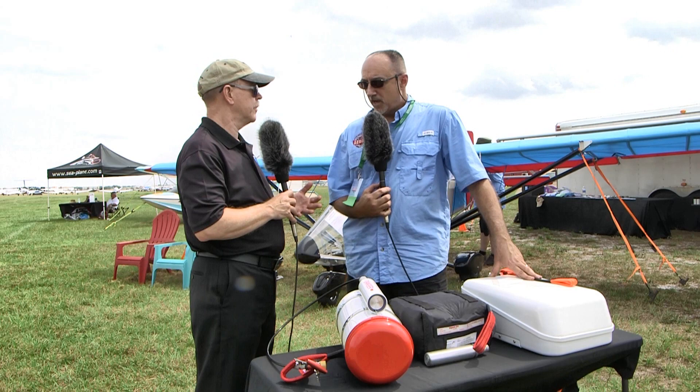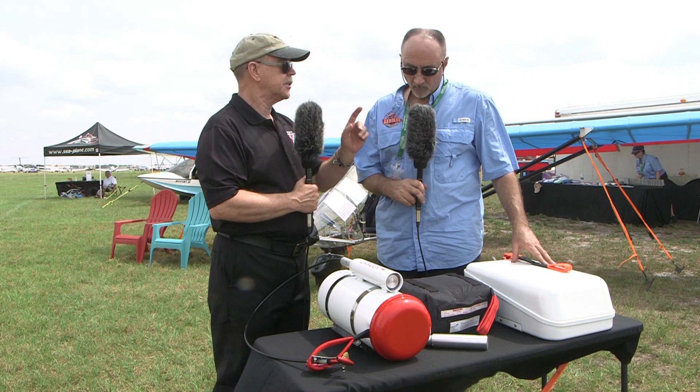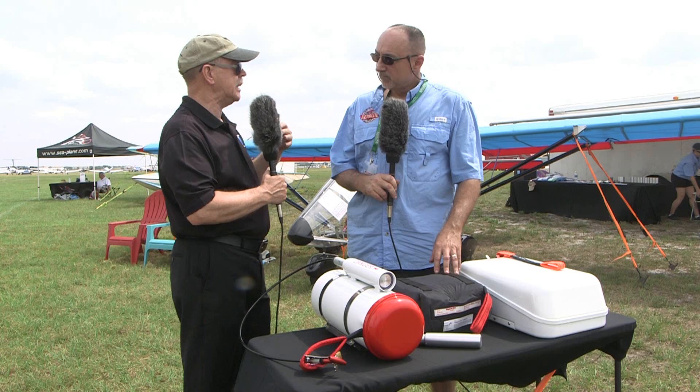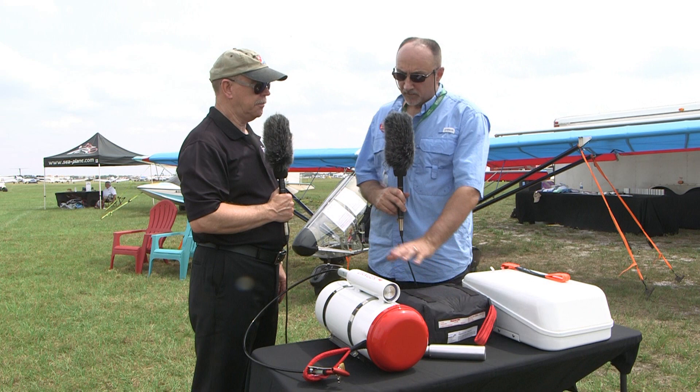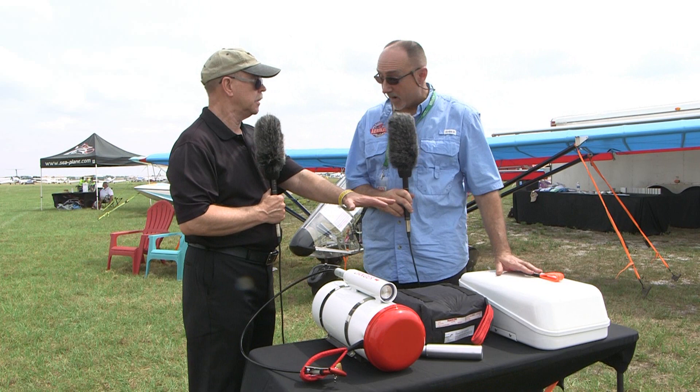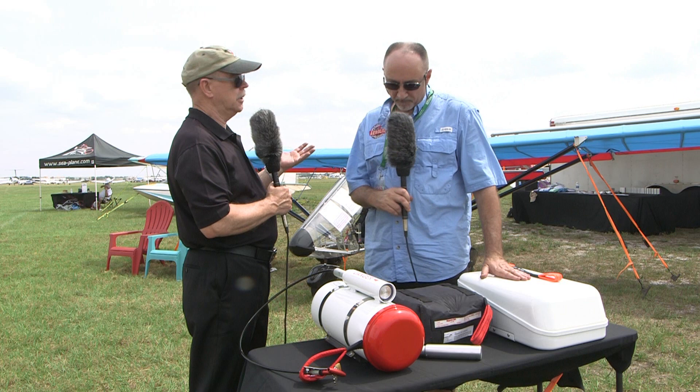For a standard aircraft, they can typically get a unit out in two days. On maintenance intervals: the canopy inspection — including soft packs — is every six years. The rocket motor inspection is also at six years, and the rocket motor itself is replaced at 12 years. These intervals apply to all three system types. The six-year canopy service is mostly an inspection, and if everything looks good you put it back in.